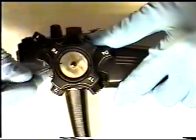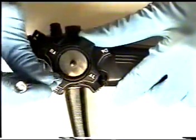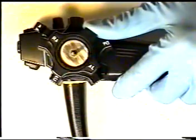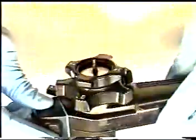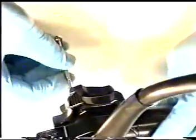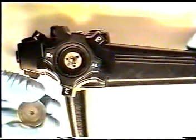Next step is to remove the left-right pressure plate with either a small number 1 or 2 screwdriver or tweezers. It may be necessary to turn over the endoscope and tap out this piece. It will fall out with gravity. Put your pressure plate back with the other parts in sequence.